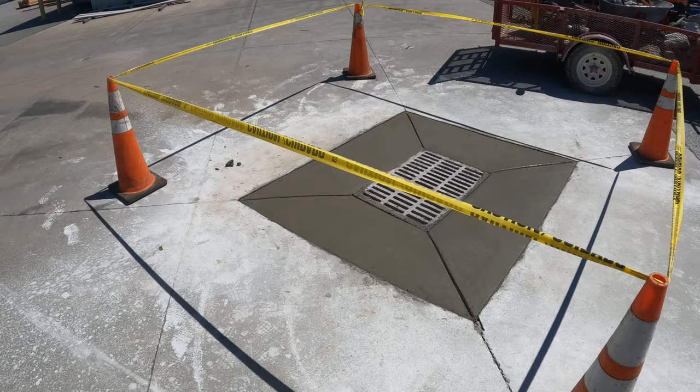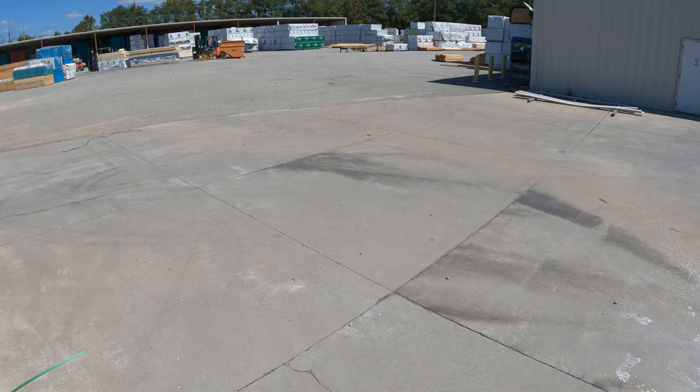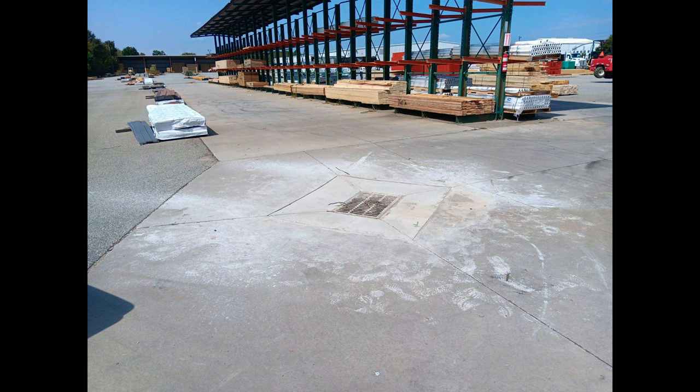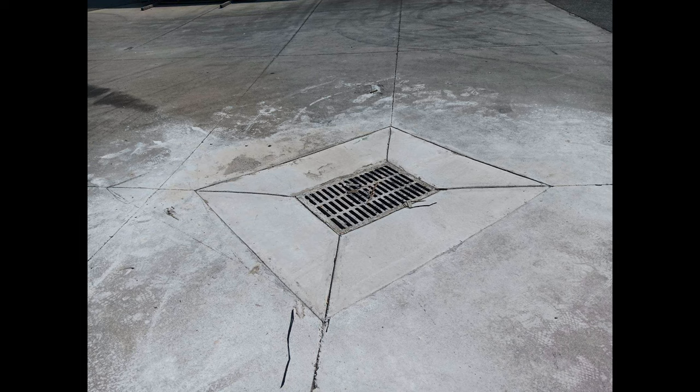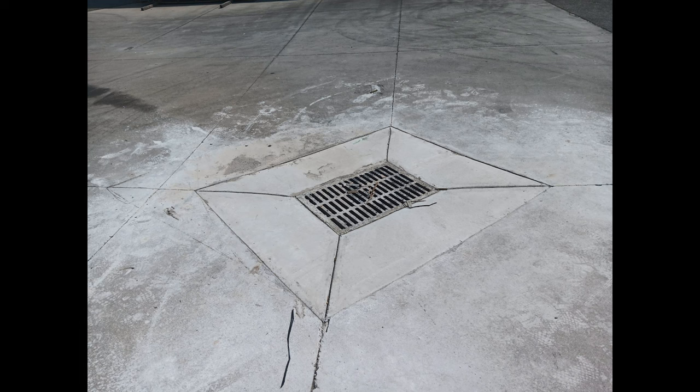I think we are finished. I'm going to leave these cones up for a week and let that concrete really set up well before they start running all their forklifts and everything across it. It's been a couple of weeks and Ronald zipped back by to get the cones and snapped a few pictures for us. Everything turned out really well — they've been driving over it for about a week now and no cracks formed. Putting that wire mesh in there, doing fiber, and doing the 4,500-pound concrete mix was the ticket. Everything's good — they weren't too worried about us cleaning up the residue from the cutting process, and this one looks really good.